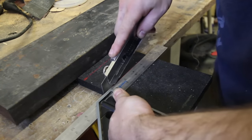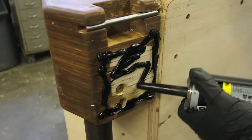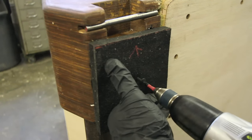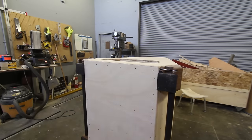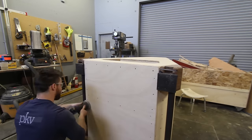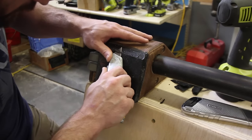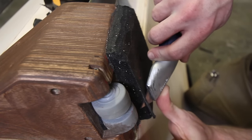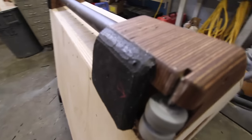The whole box rests on these rubber feet, which get glued to the feet I made previously. I just cut these with a sharp utility knife — replace the blades pretty often. Here is black polyurethane adhesive, and I'm using screws here to clamp it onto the box so I can continue to work elsewhere. Otherwise you can use weight to hold it on while the glue dries. I remove those screws and then form the rubber by hand just to make sure there aren't any edges that are going to catch on things when you're dragging this box around.